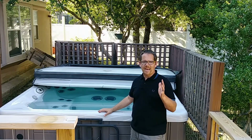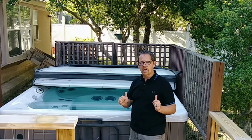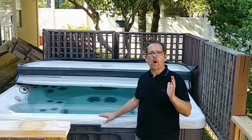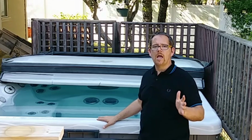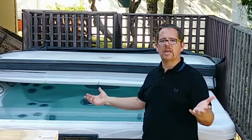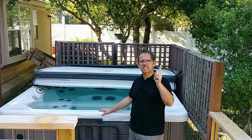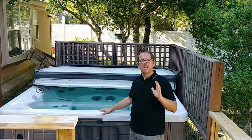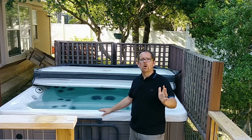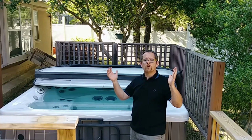So I've given you some of the minuses of plug-in hot tubs. Next, I want to tell you a story about my last hot tub at my previous house. It, like this one, was one that had to be hardwired in. I thought I would save a lot of money by buying a used one on Craigslist, having it delivered, and then hooking it up and doing any repairs that were needed myself. I did that. However, the one thing that I neglected to do was check my breaker panel and see if I had any available slots open. There weren't any. And what that meant was that I had to hire an electrician to come out and completely redo my breaker panel. It was a royal pain.